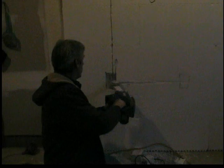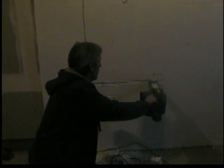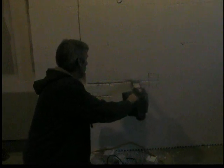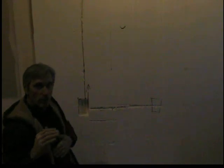It's eight inches on center. Right there, I'm hitting this one, but I'm just hitting the very back part of that right there, so I'm not cutting the furring strip. Now, if you have to, you have to — it's no big deal.